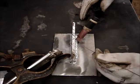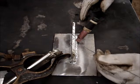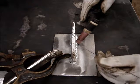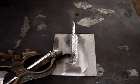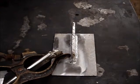You're moving very slowly. You can see by looking at the weld pattern that I have there that it's a little dip, and we make a little wave, and then you dip it, you let the metal heat up, and you just keep on going like that. Most of your aluminum welding is done freehand, and what I was doing there was freehanding.